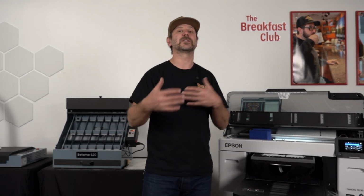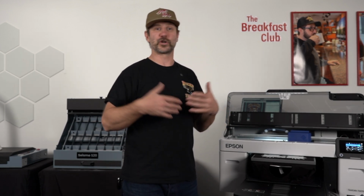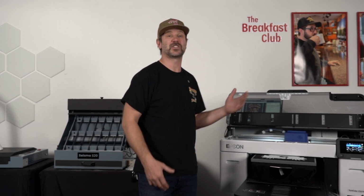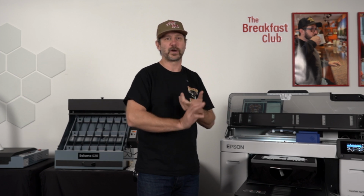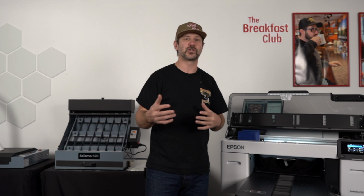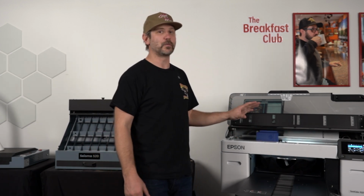And I think that's because Epson is constantly making changes to their ink and rolling out new versions of ink without necessarily letting anybody know. They're just kind of running changes. It's just getting better and better and better. So generally you want a high quality ring spun cotton shirt. You want to pre-treat it well. Those two things are going to ensure that you get really good results. Also, you want to make sure you nozzle check before you print every day.